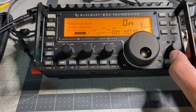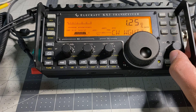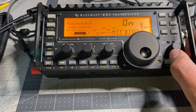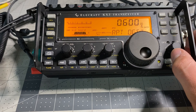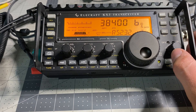Keep scrolling. The next thing we're going to get to is mic bias. I left mine on — some people say you need it off, I don't know if it really matters. Mine is on. Then we want to keep going — that's preamp. We'll go ahead and turn our preamp off, that's what you want to do. Here's your baud rate, RS232, down there at the bottom — 38,400 is what you want your baud rate to be.